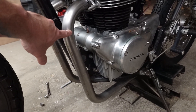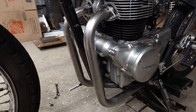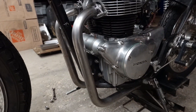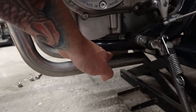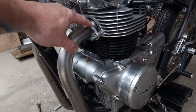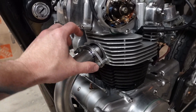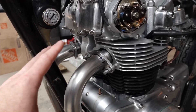I actually had designed and had these bent a couple years ago from a company out west. I can't recall the name of them — if I can find the original order, I'll put that down in the description. These are 16-gauge, one-and-a-half-inch diameter tube. I wanted one continuous sweep here, and then it levels out underneath. I've got about three-quarters of an inch clearance, and they do clear the oil drain. The flanges and the collars I had a friend machine from drawings I sent him. This way we eliminate those big, bulky collars and the little two-piece keepers from the original Honda exhaust — everything will just be one piece, bolt up nice and neat.